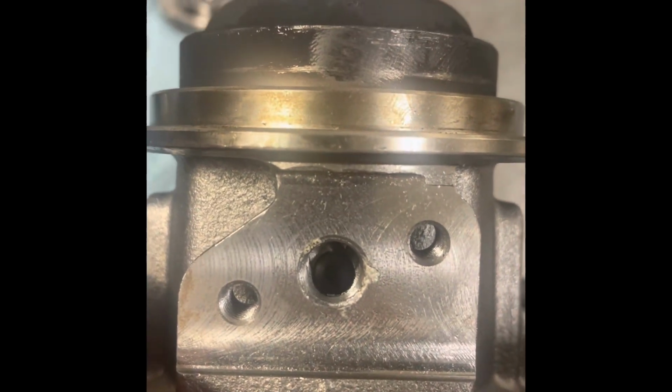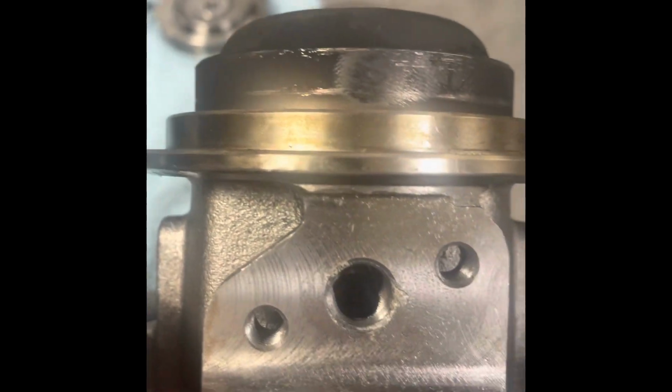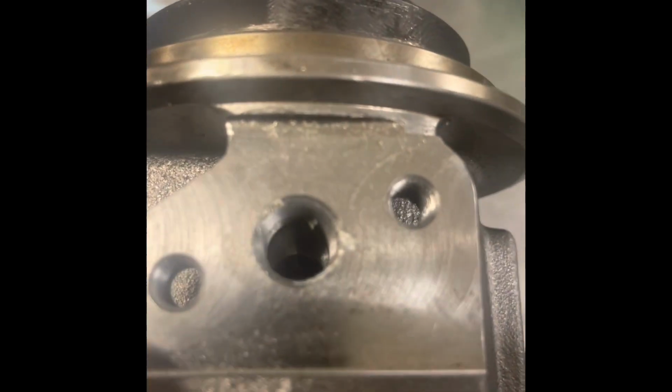So any contaminant that goes in there, well, here's a chunk of paste in there, and there's a chunk of metal in the front bearing. That was from one of the holes. So here's a piece of debris that came out of the front bearing. Oh, there's little holes here. Yeah, you got into an oil feed hole. They're all plugged up. There's more than just that chunk stuck in there. There's a chunk in that hole.